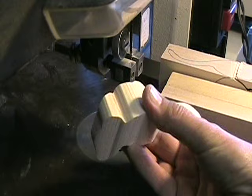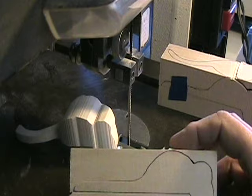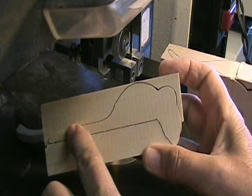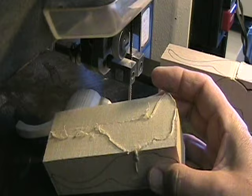It's a very difficult blank to cut out — it doesn't have much wood to it, but it's very tricky. The first thing I did was on a piece of wood of the right size, which was like one and a half by two by five. I drew on the pattern and cut out the side view. You have to decide whether the side or the top would be the more difficult one, and in this case it's much easier to cut out the side view first. I actually cut out this part using the ripping blade on the larger bandsaw and made a stop so that they all stopped at the same place, because I was cutting out a whole bunch of these at once.